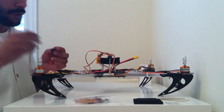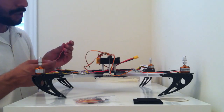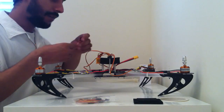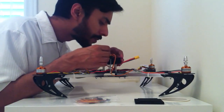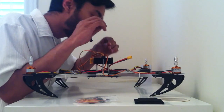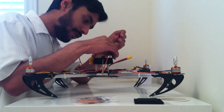Finally, all we are going to do is install the LiPo alarm which came with the KK board. Essentially this is just a low voltage alarm which we will set up when we are configuring our KK board. We will go ahead and plug it in for now. The KK board shows you which side has to be positive and which side has to be negative — all you do is follow that marking.